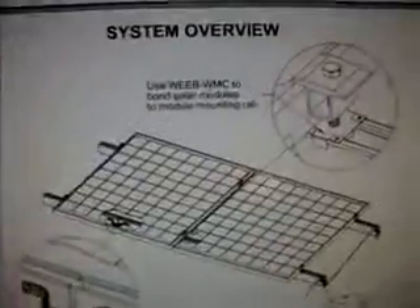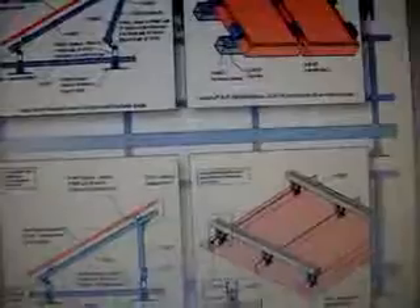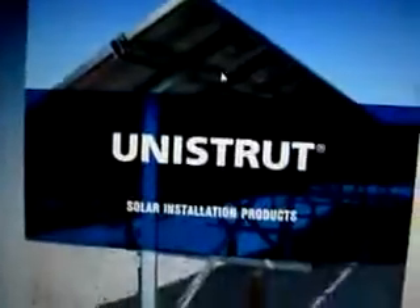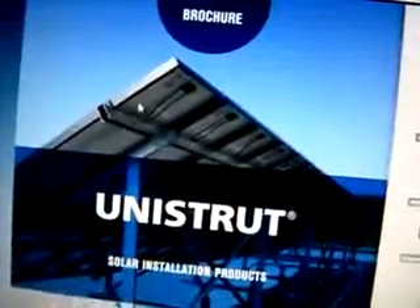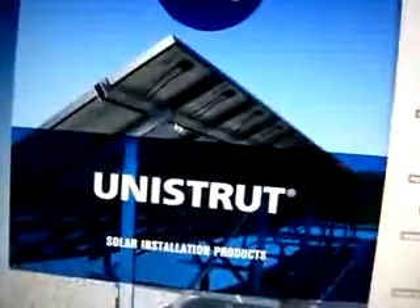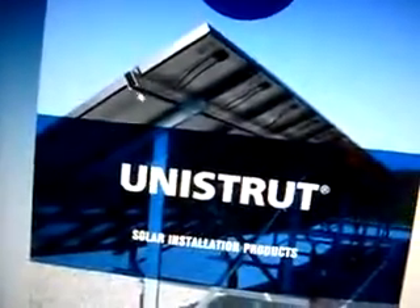Let's see if I can find a picture of what this should look like when it's done. It should look something like this. We'll invent a mounting situation for our roof when the time comes. Of course it will be different at 329 Hancock, but you can see all the panels lined up here from the Unistrut. They're using 2-inch Unistrut; we'll be using the 1-inch.